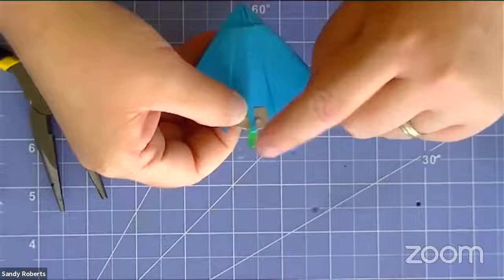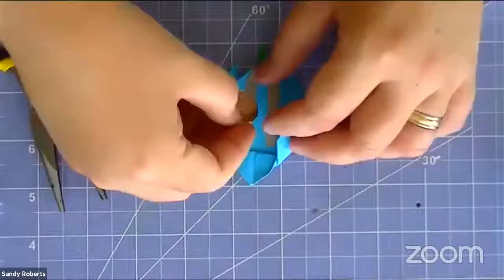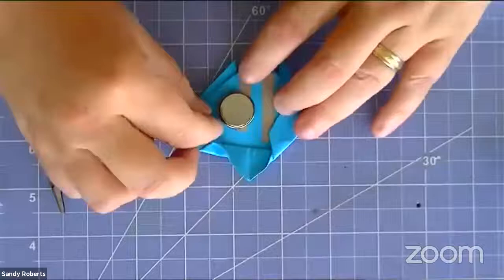Keep the two tape lines separate — that's really important, because if they cross, or if the leads cross, you'll short your circuit. The electricity would just not bother going into the LED and it wouldn't light up. At this point you want to test, test, test — I should have wired this correctly. I did! So now we are going to attach our battery.